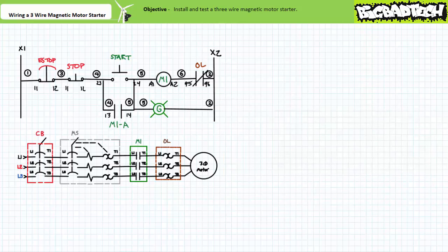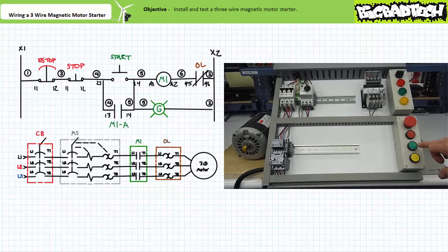Additionally, consider a three-wire control circuit making use of an overload in the automatic reset mode. In this case, I'm simulating an overload event by pushing in the manual test button. The open overload element signals the contactor to open as expected. When the overload element in automatic mode cools and resets — i.e., when I stop testing it — it automatically resets. Note the motor does not suddenly spring to life since the holding circuit has dropped out. Only when an operator makes the conscious decision to actively restart the system does it do so.